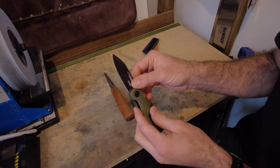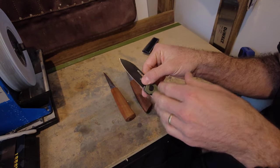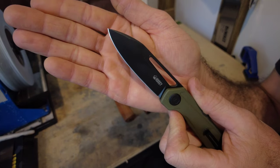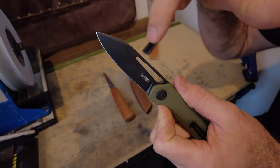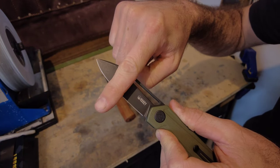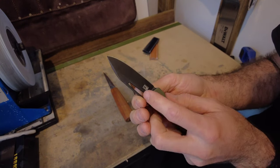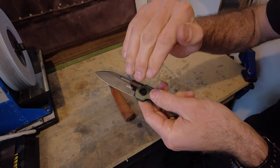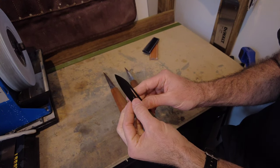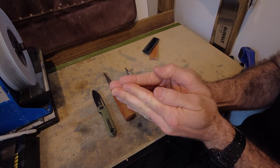Now we get to what most people would be most familiar with: a flat grind, a saber grind — there are a whole bunch of different types in this EDC realm. But what this knife has, and what most everyday pocket knives have, you can see because this is a powder-coated blade — there's a bevel that starts way back, but the very edge has what you would call a secondary bevel. It goes flat all the way and then just dips right at the very end, and what that creates is a lot of strength, because you have a very small amount of edge behind a very wide piece of steel, and it makes it very slicey because you can get that edge really, really tight.